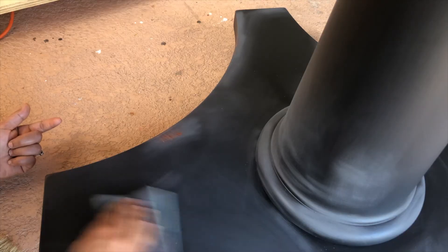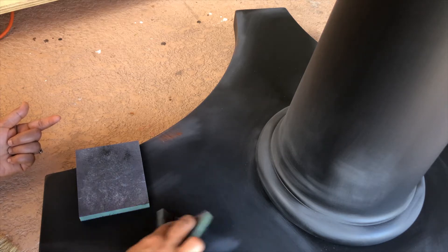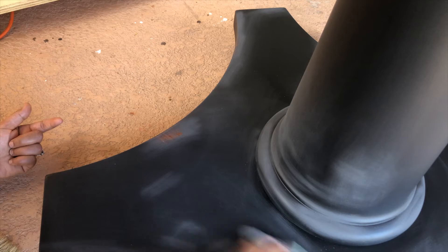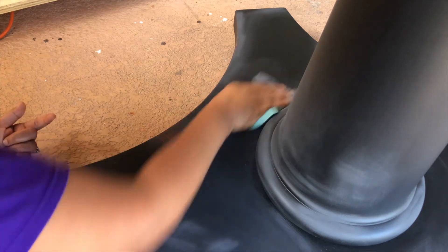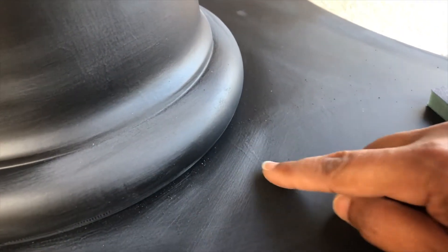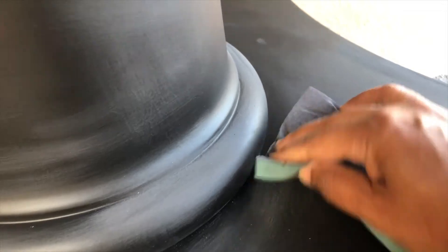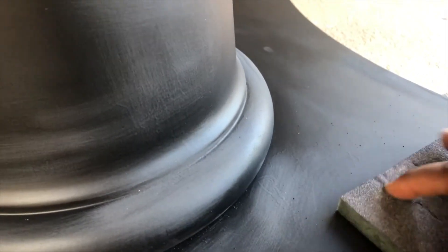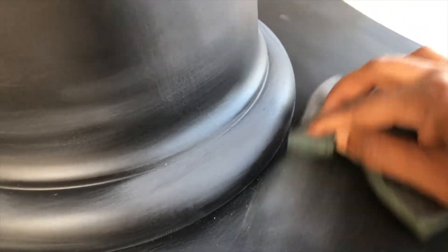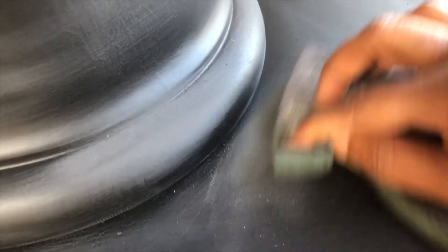I did one coat, then a few days later I turned the table back on its feet. Here's something you should always do if you want a silky smooth finish: sand between coats. I know it feels counterproductive because you're putting dust all over your new paint job, but look — you can see there was a bit of a run. You want to find those and sand them off before layering up with another coat. Do the same as you layer up with top coats. These feel like extra steps but I promise it's worth it — you're guaranteed to get a silky smooth finish.